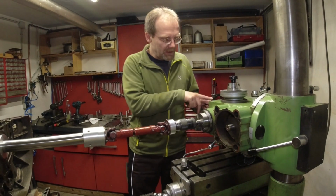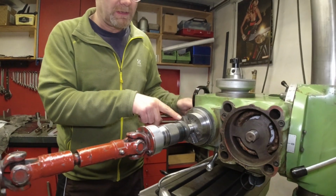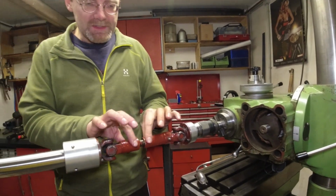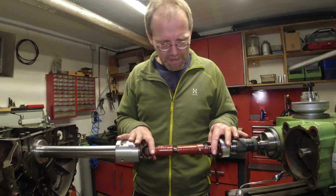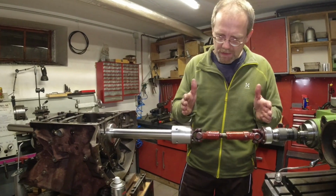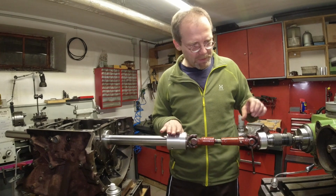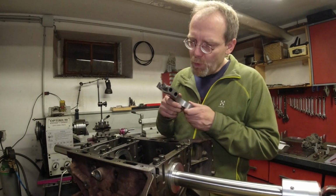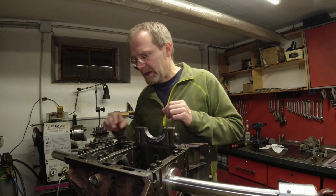Okay, and I got a little bit of an advance here with a crank, and this advances the drill head. Then I use a regular drill chuck, and I have this little crankshaft, been lying around for 20 years. It's from work. It landed in our trash container, and I took it, maybe 25 years ago. You need something to take out the incompliance, and this little crankshaft was perfect. So just one more adapter machined, and done. Now I was able to bore out the two mains to the original diameter of 75 millimeter.